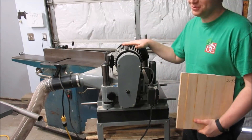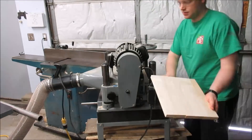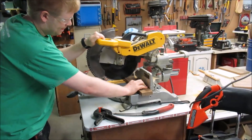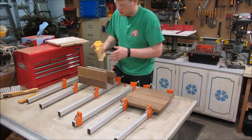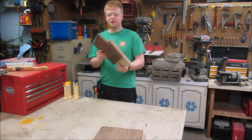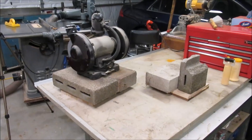Unlike the jointer, this is a 15 inch planer so I have plenty of capacity to do it all in one pass. Now I'm just looking through my scraps of walnut to see if I can find the right pieces to complete these blanks. In no time at all I'm gluing up the walnut. Same story — I'll joint and plane these down. So now I have my slab of maple, my slab of walnut, and I'm gluing them together to make a thicker slab.